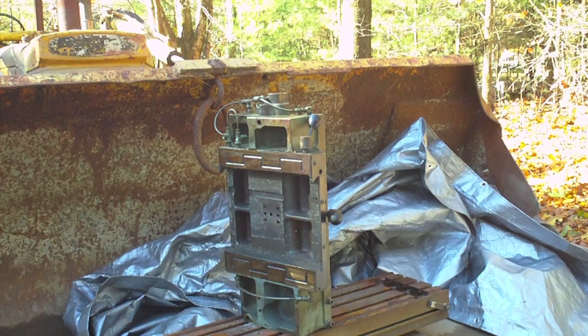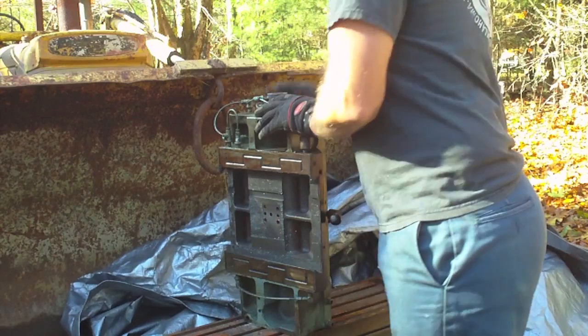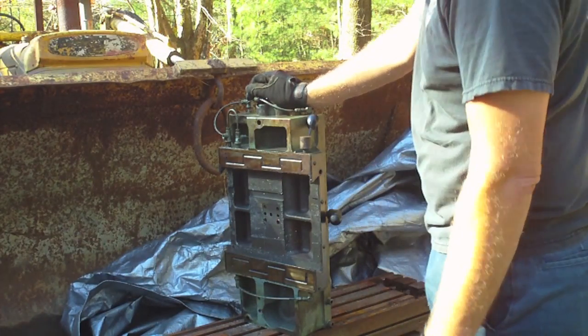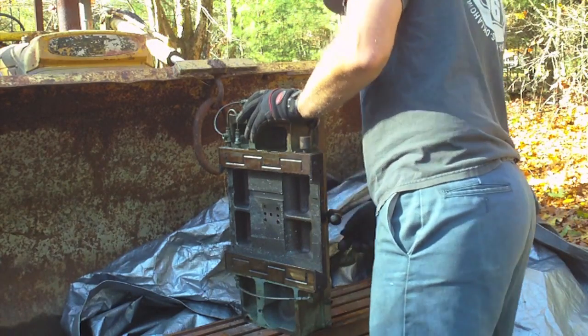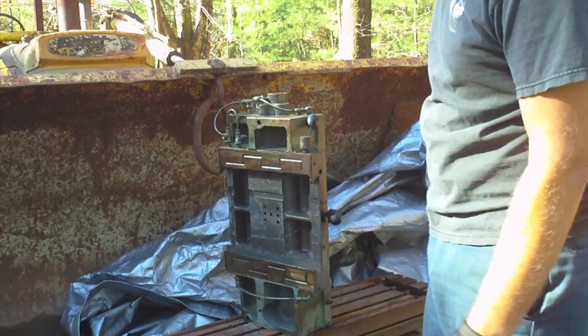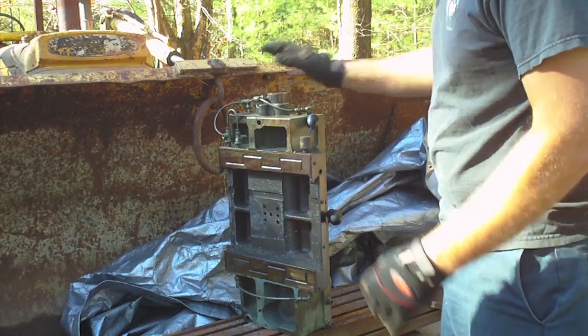Well, it's been a few days. We had a lot of rain, and this is no way to treat your index mill components. The parts I had over here are partially blown off. We had a lot of really strong wind that blew rain in here, and the top of this had water sitting in it. There's flash rust on the ways on the top that wasn't present before — I really did a number on that.